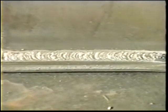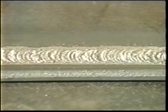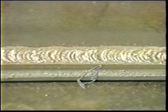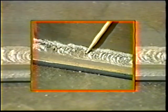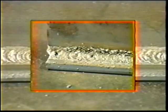The standards of acceptability are as follows: the weld shall be acceptable by visual inspection if it shows no cracks. The weld must show complete fusion between the weld metal and base metal. There shall be no slag inclusions exceeding 1/8 inch in any six inches of weld. There shall be no porosity exceeding 1/16 inch maximum, with no more than a combined total of 1/8 inch in any one square inch of weld.